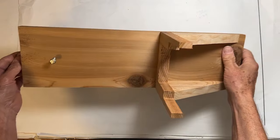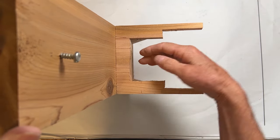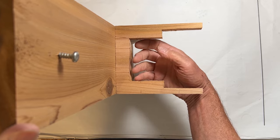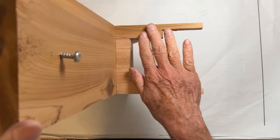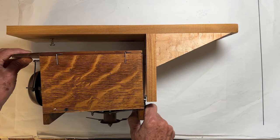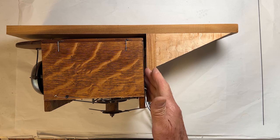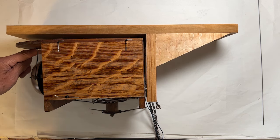Here's the test stand I used for these — it's actually a perch rather than a shelf. It gives clearance for the pendulum, chains, and rope. The perch supports the bottom of the clock frame and prevents the frame of the movement from sagging from the heavy weights.